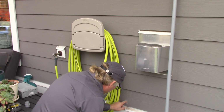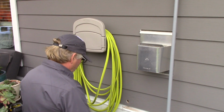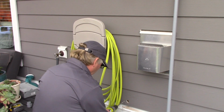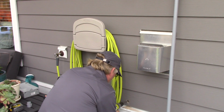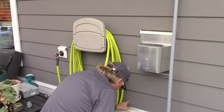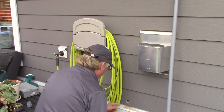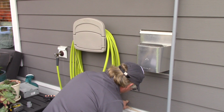There's some aluminum flashing behind here that I didn't count on, so I'm going to get a hole saw and saw that out. Alright, so I put a metal hole saw on here and just sawed through that metal, just so as not to wreck my butterfly bit, although they're not that expensive. Now we'll carry on through the wall sheeting. Murphy's Law says I'll probably hit a stud here instead of just sheeting. And I'm through. And as I suspected, just right on the edge of a stud, but we're good.